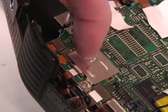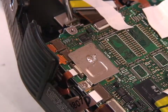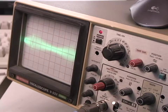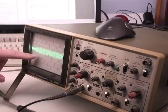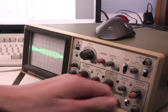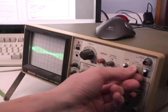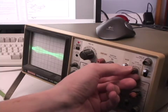The head amplifier is in this can and the bit we need to probe is that test point there. That doesn't look too good to me. You'd expect this to be flat like a big rectangle. I'm not quite sure what's going on with the trigger — I'm not sure if it's a triggering issue or a mechanical issue with the machine.